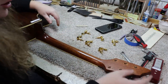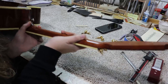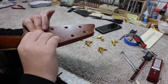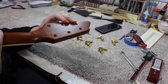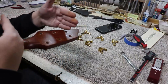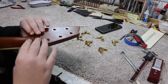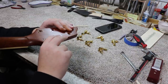We've got the tuners off. Now we can start to take a look at this break. There's a little bit of flex there, but I don't think it's broken all the way through. The biggest thing is going to be clamping it down flat. I can do it with my fingers and it closes up pretty good. The biggest challenge is getting glue all the way back in as far as it goes. It's not broken off flat — it's broken at an angle, so there's a lot of overlapping grain I can glue together. It should be fairly strong.